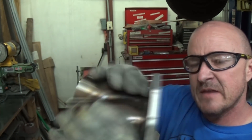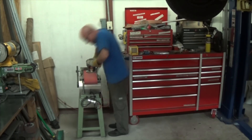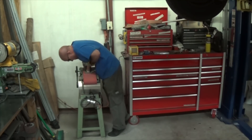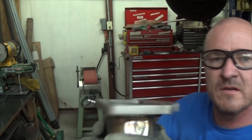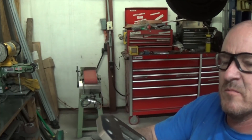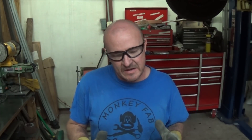So there we go — there's still a little bit of a low spot right here, but that tab isn't a sealing surface so don't worry about that. Just thought it would be interesting. I see this every time I weld these — stainless steel just likes to go whatever way the heat goes. So just something to keep in mind when you're working on your projects: clamping stuff down is huge for controlling distortion. True story.